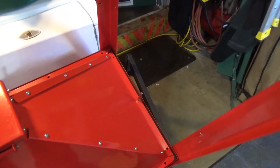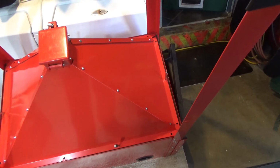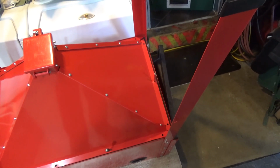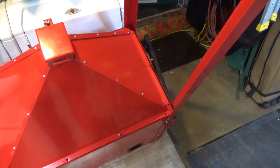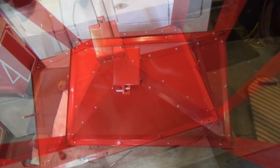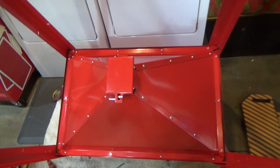It's not that the screws can't easily push through the foam, they can. The problem is that the adhesive's great, the foam is crap. And the adhesive sticks to everything you poke through it, and it makes a huge mess. You don't want that on the threads of these screws. They're all metric, so they're very fine pitch. I got all of them in place except for the far corner.